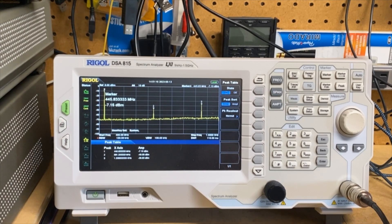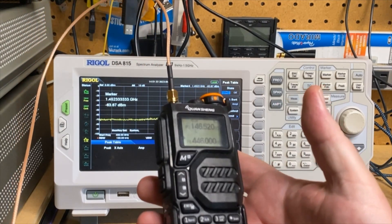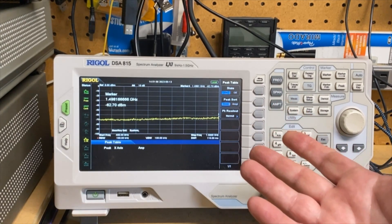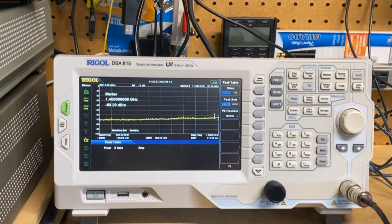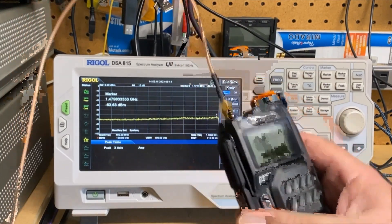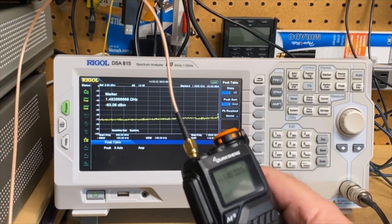That's pretty terrible. I don't recommend this radio — certainly not on UHF at all — because it does not have adequate harmonic suppression. Sometimes you can get a cheap radio that's a bargain. I have a UV-6R and I'm pleased with it. It looks great. I did a video on it where we did this same thing and it does not have the harmonic issues. It costs around $29 to $35, about the same price as this. They're both available on Amazon and I'll put a link in the description below. But I would not recommend this, in spite of all the cool features that other YouTubers have shared. I cannot recommend this because you're going to be splattering all over the band.